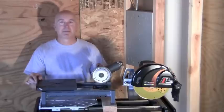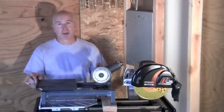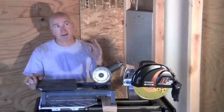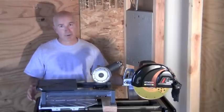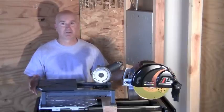And the next level was I purchased the MK470, retrofitted it with co-action technology, and the results were pretty impressive. I took a saw that would only cut a rip cut of 14 inches. I was able to increase that to 24 inches using the same water pan that came with the saw. So that meant the length of the rails did not increase.